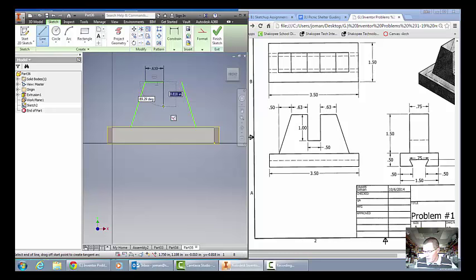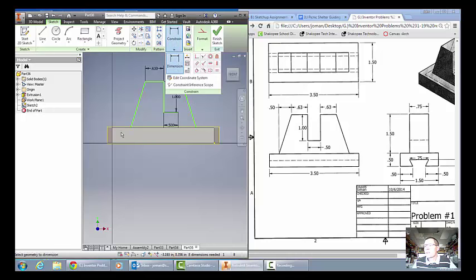1.63 in, one down, 0.5 over. And I'm going to find out real quick here that something's not quite right with this. You can tell my spacing's not done well. So we have to go back and calculate. It looks like I forgot to add in the 0.5 that was over here, so it's actually 2.75 total right here. 3.5 minus 2.75 is 0.75, or 3/4. Divide that in 1/2, you get 3/8. As a decimal, that's 0.38. So let me redimension these two spots.